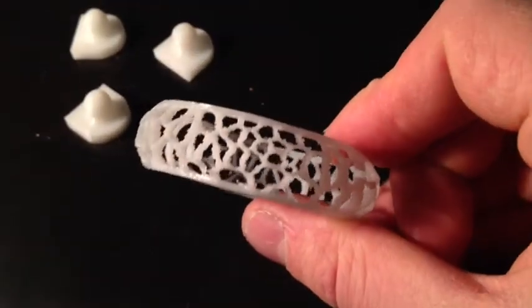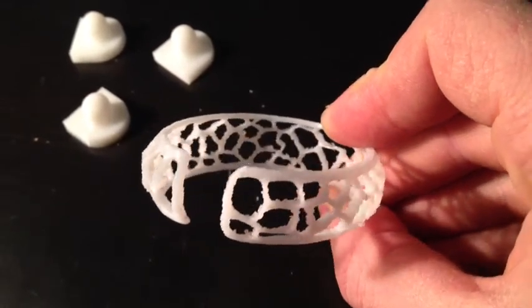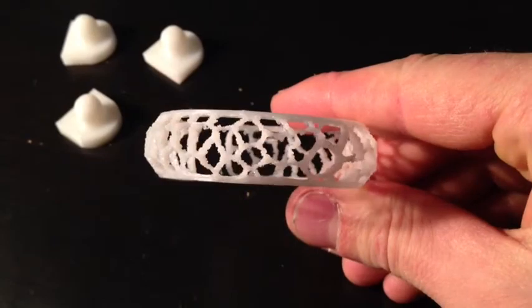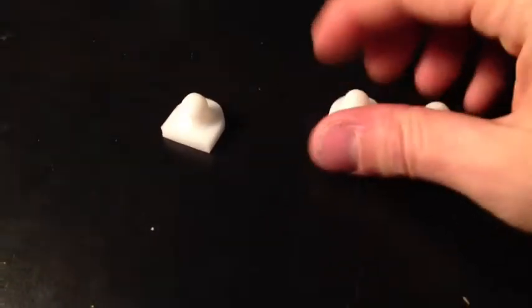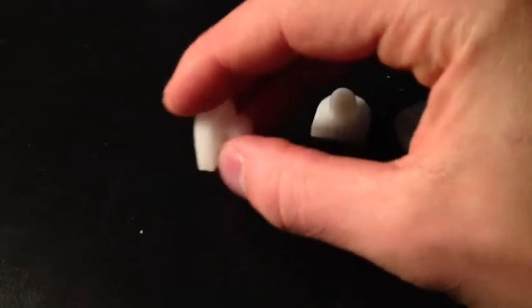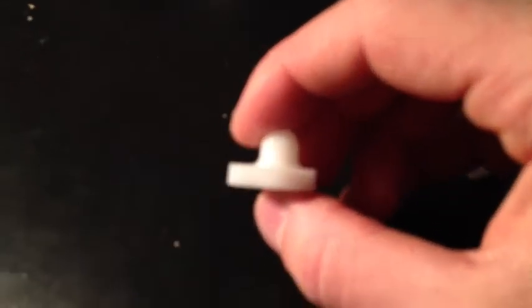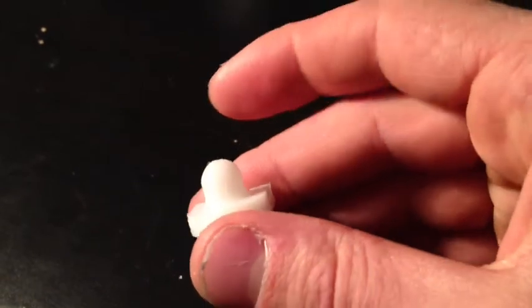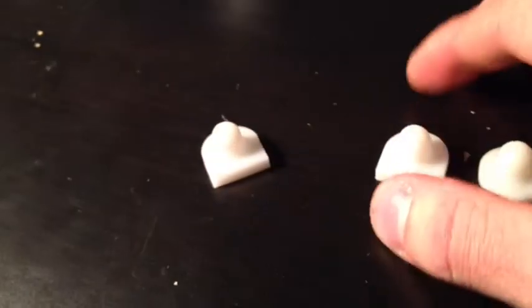Retraction setting needs a little bit of work yet, but not bad. I'm going to add 0.15mm layer height. These are some of the calibration blocks I was printing earlier — this one's a 0.1mm layer height. You can see my Z constraint is a little bit off; there's a little bit of wiggle coming from the threaded rods. These are printed single, so the fan's doing its job because there's very little melting at the top. Nice smooth curves. This is 0.15mm.